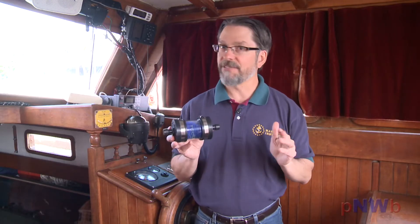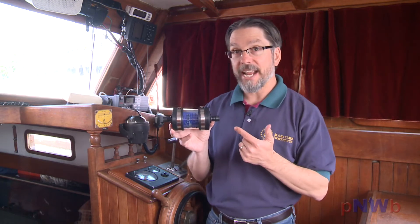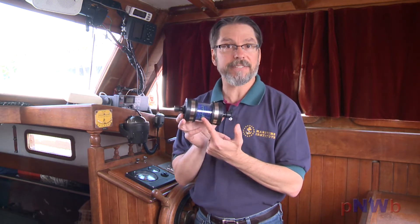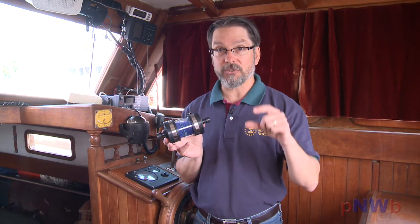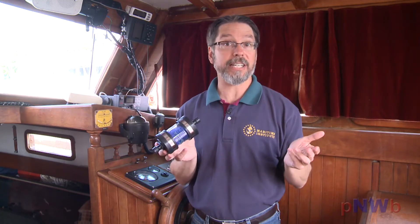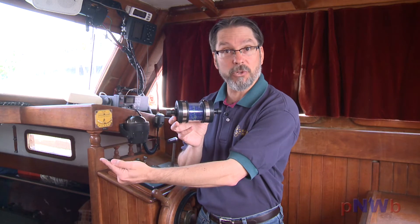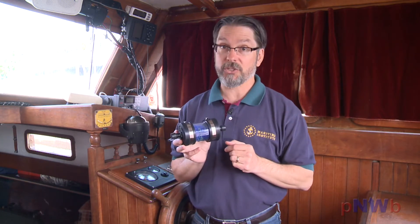How it works is very simple. As air enters the dryer it passes through these little blue beads of desiccant — the same desiccant you find in those little packages inside boxes of electronics, shoes, and stuff like that. As the air passes through, the desiccant literally captures all the water molecules. The air that continues on into your fuel tank contains no water vapor whatsoever.